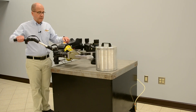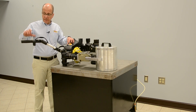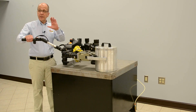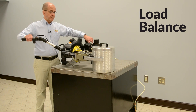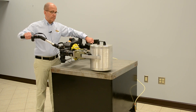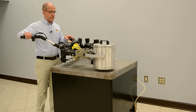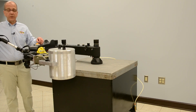The second step is to clamp the part. To clamp the part we hit the high pressure button and the red button on the handlebar at the same time. Once the part is clamped we can then set the load balance using the other switch. So we're perfectly balanced for the weight of the work piece, which is again 76 pounds.